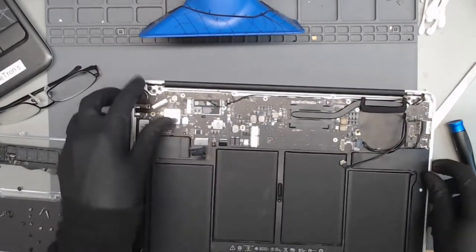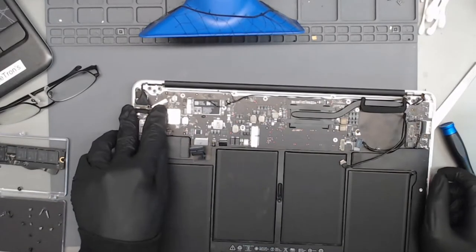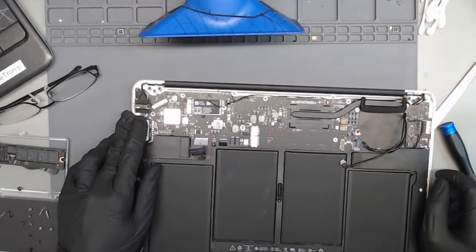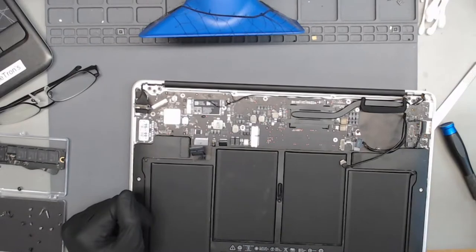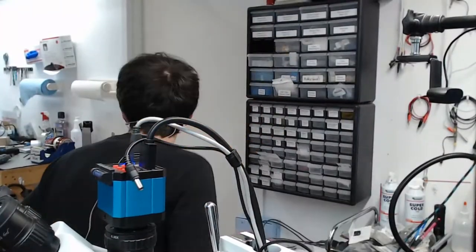Now the next part is there's one right next to our EDP port. It looks like we're gonna have to end up replacing that anyways because there is a great deal of corrosion. But with that in mind, I still need to be careful so I don't end up cutting the top layer of the fiberglass of the logic board. So, loud noise warning again.